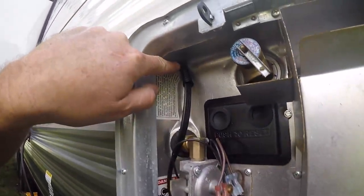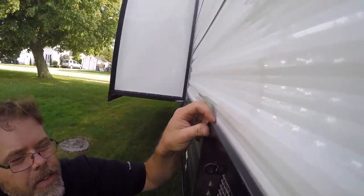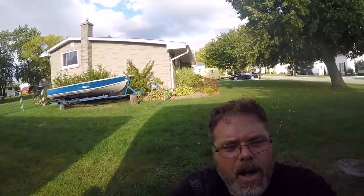I ran the wire up through there — I drilled a little hole and put it through. And then in the trailer, which is all covered back in, it comes with a little thermostat. The tank is wrapped in styrofoam, so you just gotta cut out a little spot for it and mount it to the tank. That way it checks the temperature. It comes with a plug end, so if you have a plug nearby, Bob's your uncle. But I didn't — I hardwired mine. I had an extra breaker in the trailer, so I used it. Basically I went off that extra breaker to the little thermostat, and then to the heater on the tank.